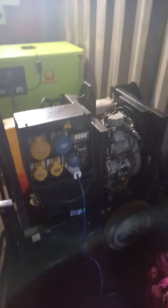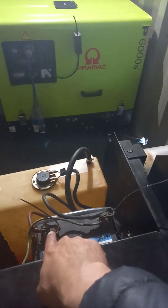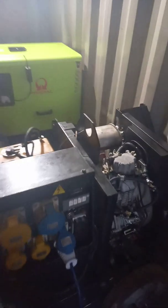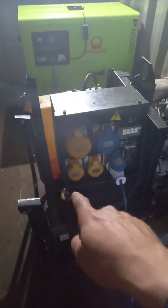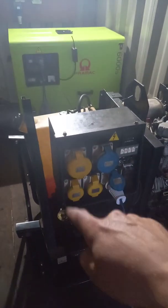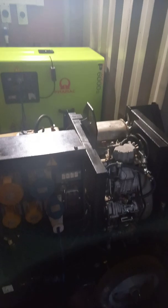You'll get absolutely nothing whatsoever. What you are able to do is bridge from the top of the battery across to the starter and you can start the unit like that, and she'll run. But what won't happen is the main pump won't operate — this is especially on the newer units. The pump won't operate, so it'll just be the lift pump drawing fuel through the system basically, and there'll be no fuel coming through the return.